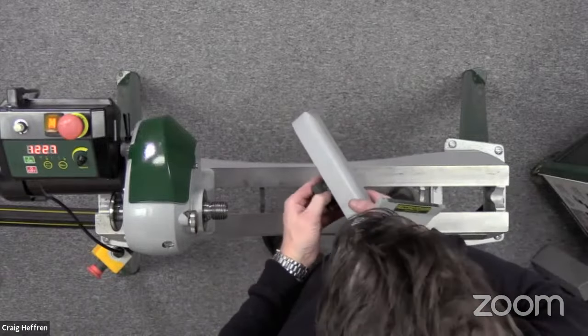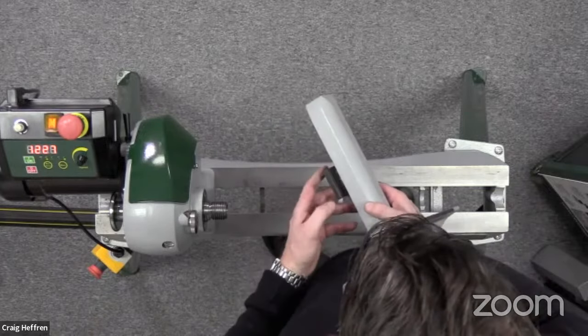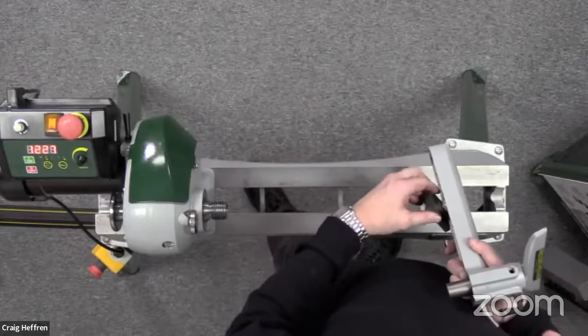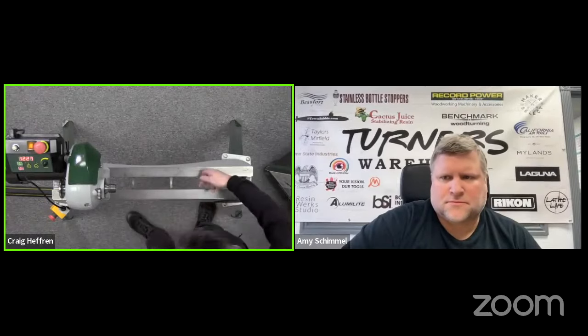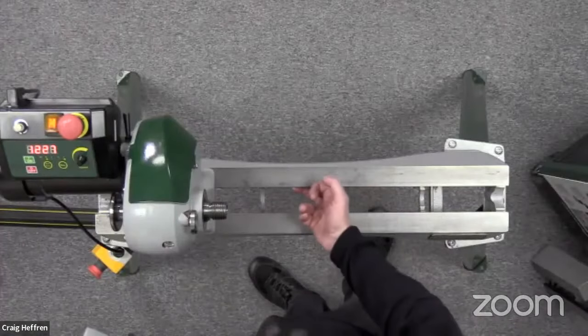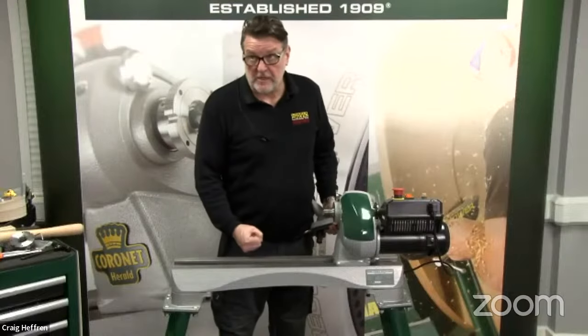And there's a pad on this side, the pad on this side. What if you gain a little bit of movement on that? If you clean these pads down, or even just rub over with a little bit of emery cloth, when it goes back on, and the recesses on the actual base or the casting mate up with them, you'll get a lot more secure.